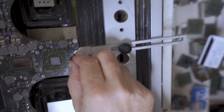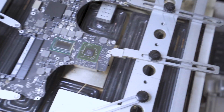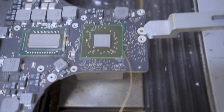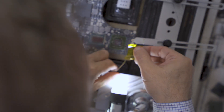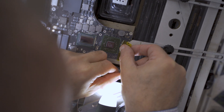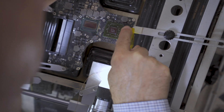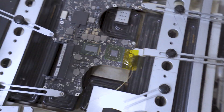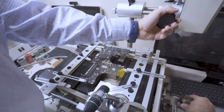Now we're going to place a small wire underneath the GPU chip, which acts as a thermometer and lets us monitor the temperature underneath the chip. We use yellow tape to hold that wire in place, because when the GPU chip is being removed, the cable can move around and shift small components on the motherboard — and we definitely don't want that.